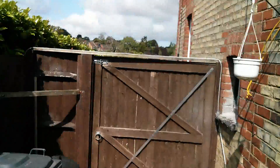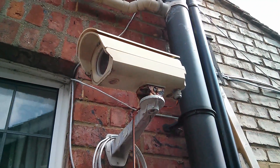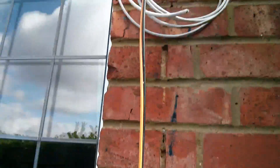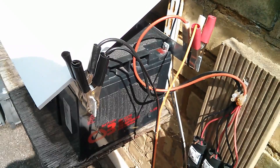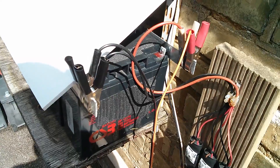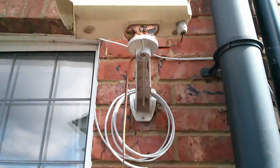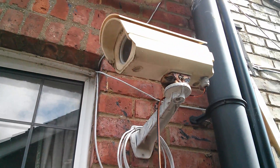Here's another IP camera on the side of the house — it overlooks the back gate. This one's not PoE; it's actually a wireless camera. Recently I made a video about putting in a little 12-to-5 volt regulator so that this red and black cable could be connected directly to my battery bank, fed directly with 12 volts. The camera runs 24/7 drawing about an amp continuously. That works in the summer but not in the winter, so in the winter these red and black cables will be connected to a mains 12-volt adapter and run out through a little hole in the window.